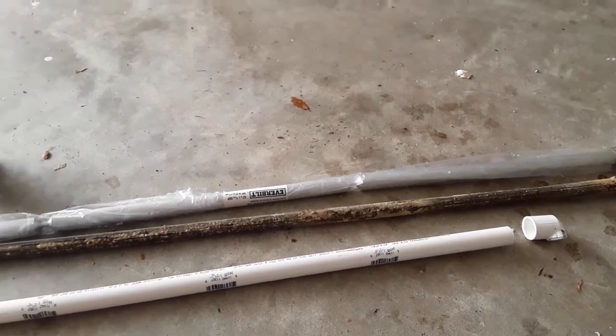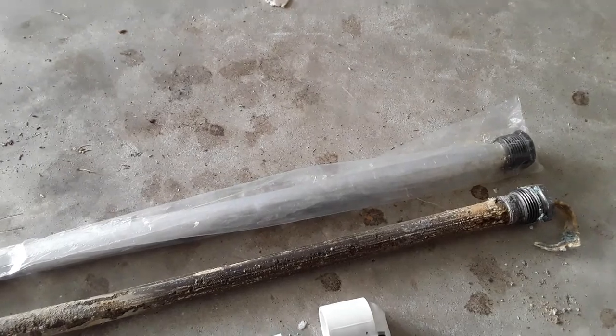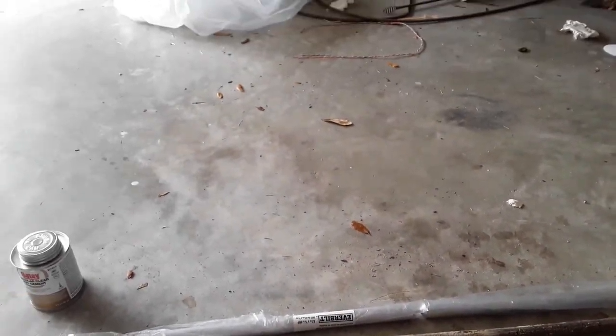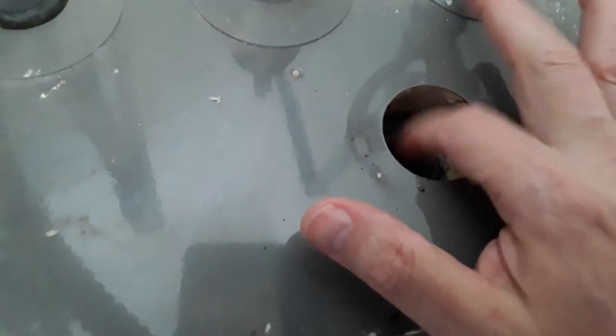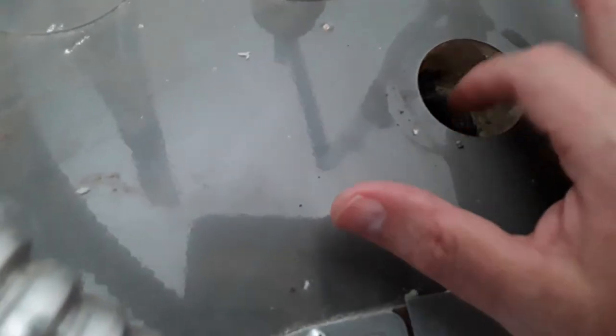There's the head of it — one-and-a-quarter inch. There's styrofoam on top of the water heater, and in the anode hole it has styrofoam and then the nut down there. You have to take that styrofoam out. I cut it out with a screwdriver — it's not very hard to get out. Then I took a vacuum and vacuumed it, and then took the nut out because I don't want anything falling inside.